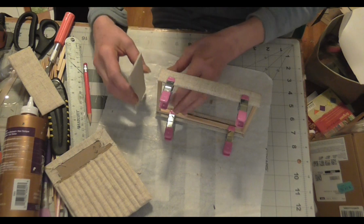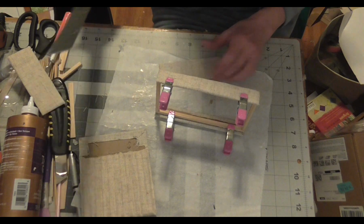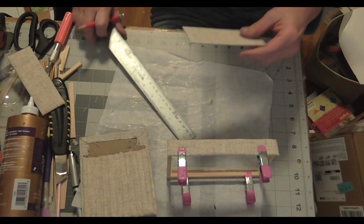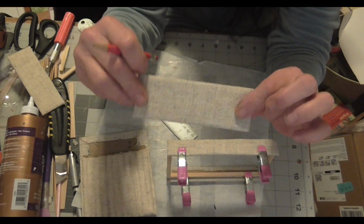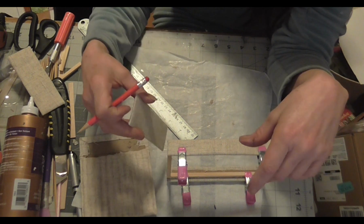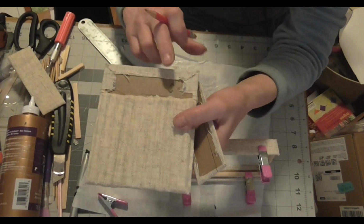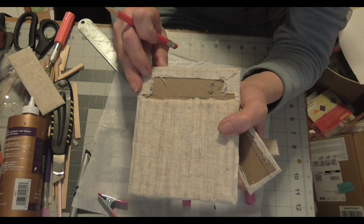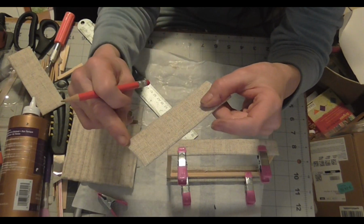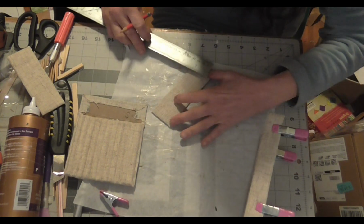But keep in mind that this piece, we need our 1/2 inch lines, and I'm just going to lightly mark those because I left a 1/2 inch at the bottom. This is the one that is 3 thicknesses. This is going to go to the inside of the bottom of the bed because there's going to be more of that showing, just like this here on the headboard. This bottom part will show if you look under the bed. So I'm going to just make a couple real faint lines on the inside at my 1/2 inch mark. Let's put that over to the side and get it out of the way.